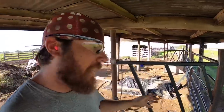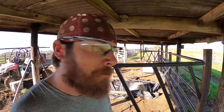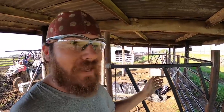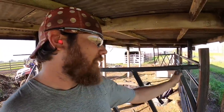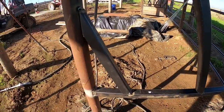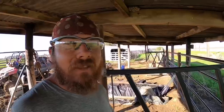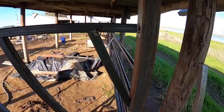All of these angled slats are looking pretty good and pretty well spaced and straight and all the stuff that I like and look for. So I think these are ready to weld in now. I do take the time to put these short ones up here in the corner and down here. It makes a lot of extra work actually, because this angled cut you can't make on a chop saw. Obviously you saw me, I had to do that with the bandsaw.